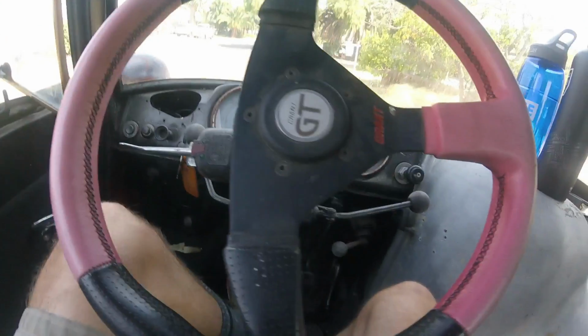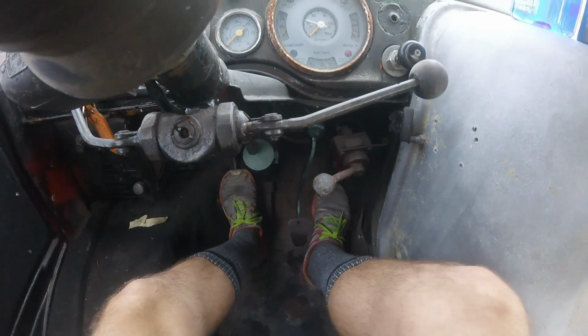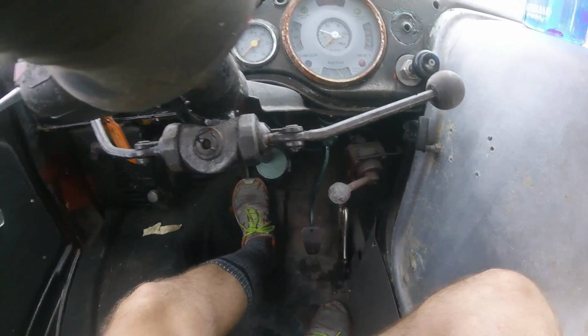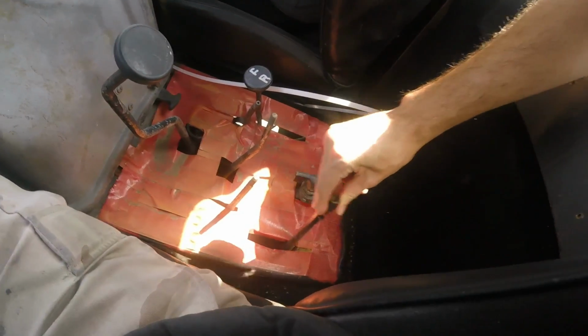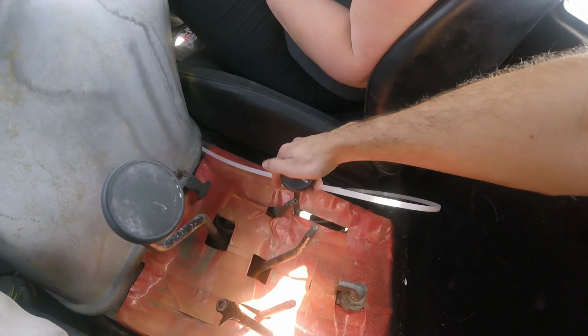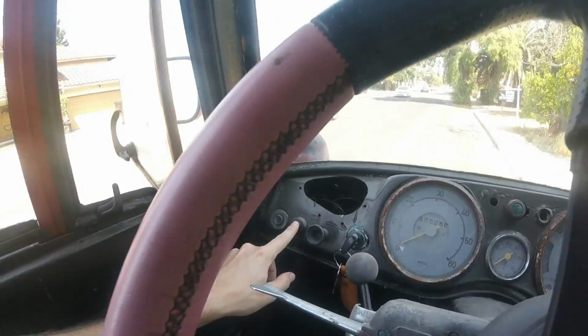Before you turn it on, clutch in, reset the gas pedal from the last time it was starved of fuel. Main transmission to neutral. Make sure you're in crawler range all the way forward. Make sure that the Johnson bar is forward or reverse, the correct direction. And in neutral, push to start.